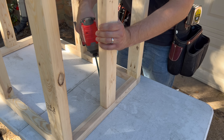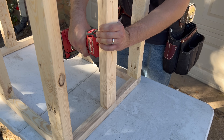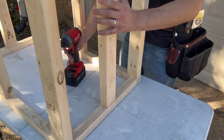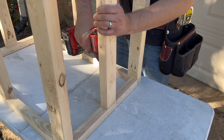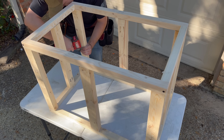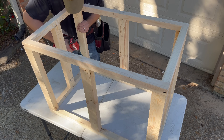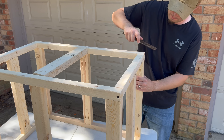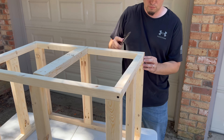After drilling the holes I used pocket hole screws to connect the vertical supports to the bottom frame, keeping the supports flush with the outside of the bottom frame to prevent ridges — if you're not careful those could eventually wear down the conductive material on the outside of the Faraday cage. Then once all vertical supports were connected to the bottom I flipped everything upside down to connect them to the top frame as well. After the box was together I used a rasp to smooth out corners and any ridges along the outside.